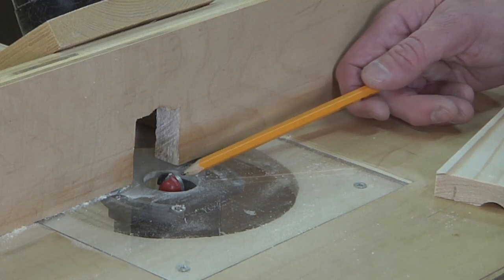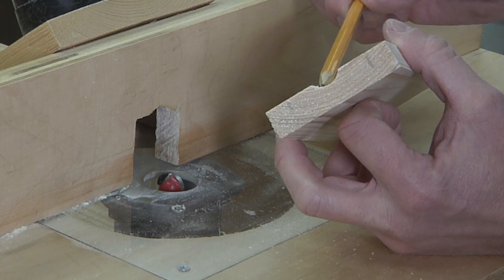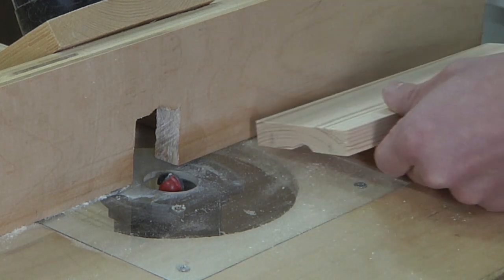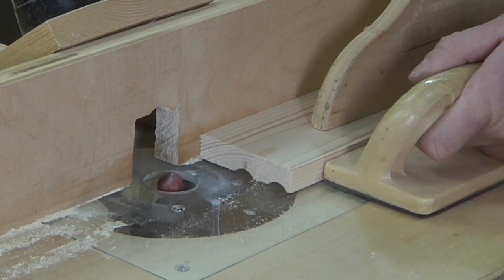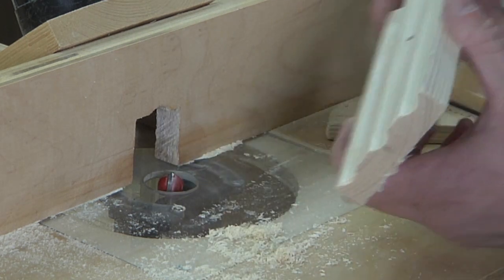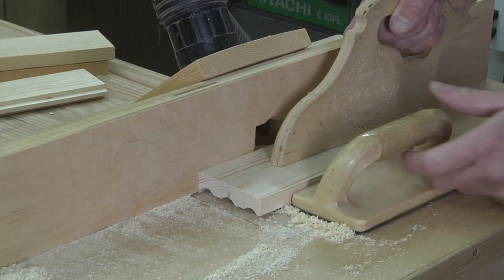With the cove bit in, this is primarily good for making fluted columns. I've already run the cove bit down the center of this board, and now I've marked two equal spaces on either side of that, and I have the fence set up for the distance away. So I'm going to push it through right now. There we are — we have our fluted column. You noticed when I was pushing this through, I had the push stick on it pushing it forward, but I also used my push block to ride next to it, putting pressure on it and keeping it against the fence.